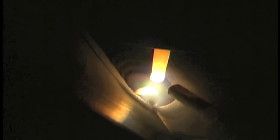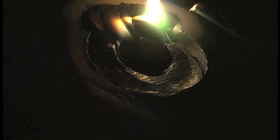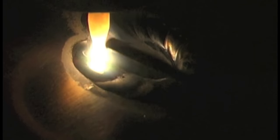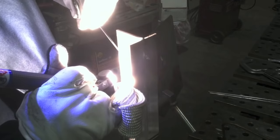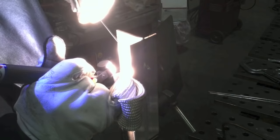Six six G, two inch 6G pipe. The hot pass is called the hot pass but oftentimes it's the same heat, just a little bit hotter. You can mix helium with argon and make a 200 amp machine weld like a 250 amp machine. Multi-pass stainless steel welds — you've got to keep them cool. Aluminum valve cover: welding a bung in an aluminum valve cover. You're not always welding in a straight line. Here are some techniques for adding rod from behind the puddle, settings for the machine, vertical uphill T joint, 3F T joint — and how a TIG finger will help you slide your hand along that joint without smoking your pinky.